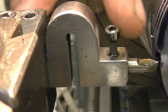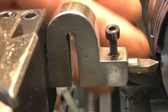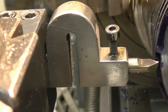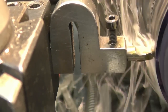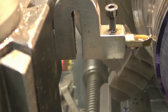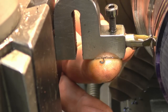The idea of this tool holder is that if the tool digs in, this actually bends and flexes, which means the tool comes out of engagement a little bit. I'll take a shot at this and you might actually see the tool flex. It's a real old fashioned idea — I've seen these things made massively big with exactly the same principle.